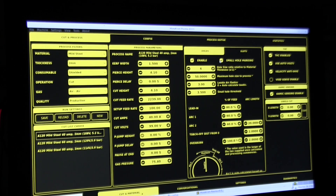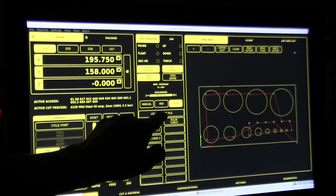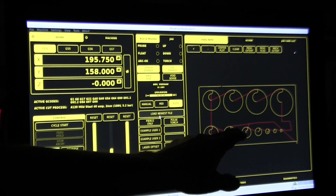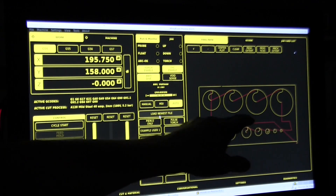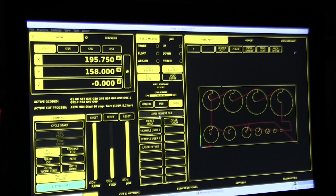If we go back here, we've turned those features on. I just want to reload that file — it'll just reload that one again. You can see now that Monochrome has thrown away the SheetCam-generated lead-ins and the actual hole cutting. You can also see that some of these holes have disappeared, but there's a straight line across there where it's going to cut them.